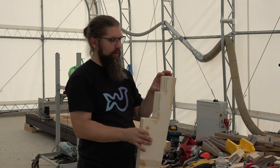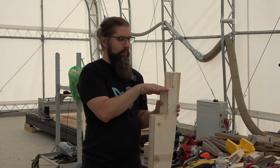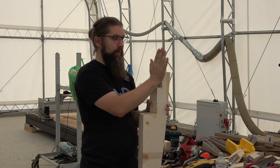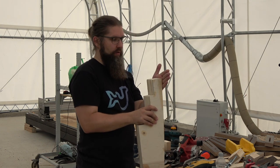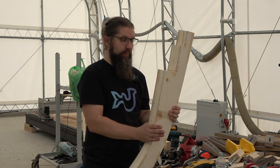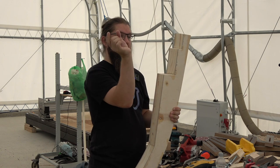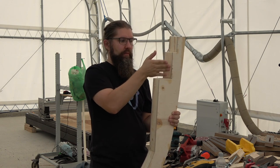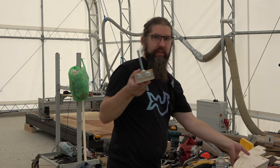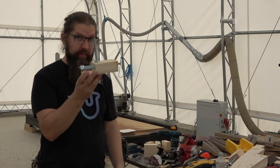And the top here is also cut a little shorter. It extends maybe like that, and the deck of the boat will be on this level, and this end will be the inside of the bulwark, and of course the shell or the strip planking will be on that end. So these will form the bulwark, and this is just a straight part where I can laminate things against to form deck beams on the other side of this beam right here. So this is straight.